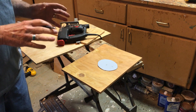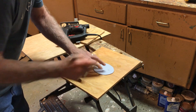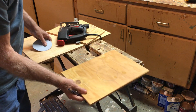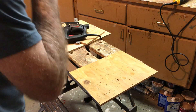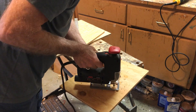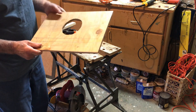The front piece where the owls come in and out requires some special attention — you have to cut a hole. I made a template for this. Mark the opening two-and-a-quarter inches down, then take a drill to make an entry cut, and use your saber saw to cut a circle. The opening cut is not very smooth, but we will sand everything down thoroughly before we put the whole thing together.